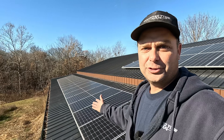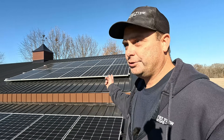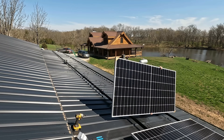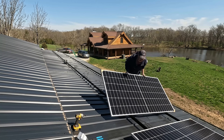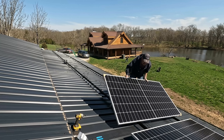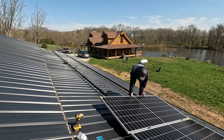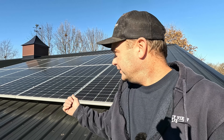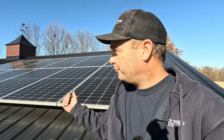The next expense is the mounting system for the solar panels. You can either do a ground mount or a roof mount — we decided to do the roof-mounted system. They're up here out of the way, not taking up yard space, and I don't have any shading issues up here. When you do a roof-mounted system you do have to buy a rapid shutdown system — that's an additional cost of about $40 per solar panel.